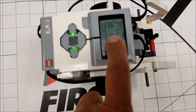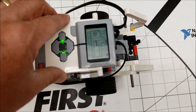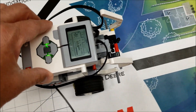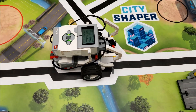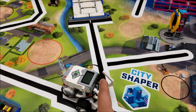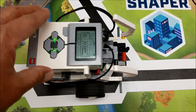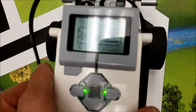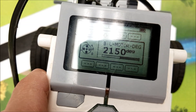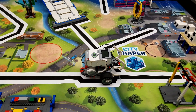I'm going to go to port view and check what my B motor registers for degrees. I always do degrees. So I push the robot along the path — and I don't have a color sensor, but I want it to follow this black line going up here. This is the perfect spot to do the turn. That's going to be 2,150 degrees. So when I go to the laptop, I'll put those degrees in for the forward movement.